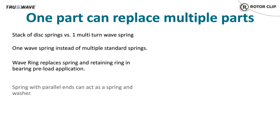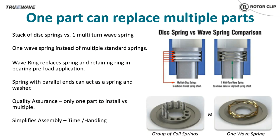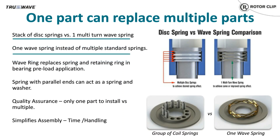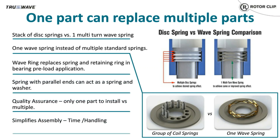In addition to saving space, wave springs can also simplify assembly and installation, improving your quality by reducing complaints and rebuilds. Many power transmission or fluid power systems use a stack of wave springs. That entire stack can be replaced with a single wave spring for a simpler, faster assembly process.